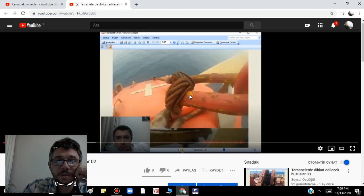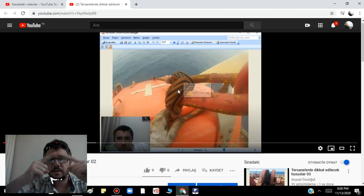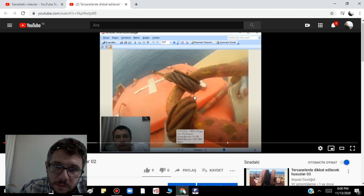You see — very poor condition, and nobody can see it. How will you understand the condition of the wire even if it is rusty? If any individual wires are broken and separating from each other, it means there is a problem. You see here — there is a wire already broken here, small wire also here broken.